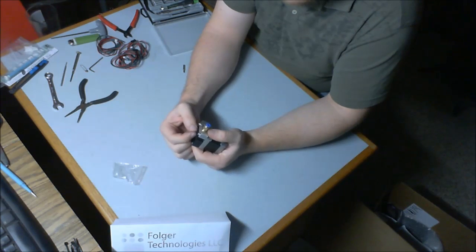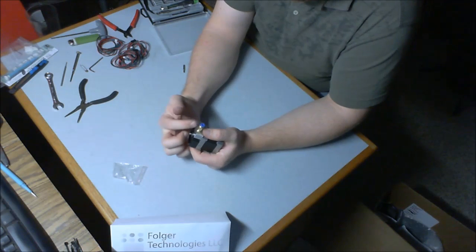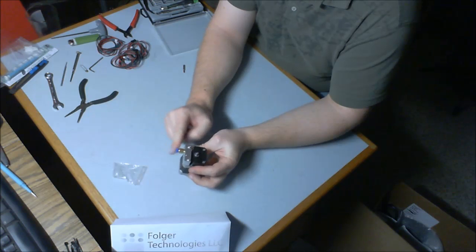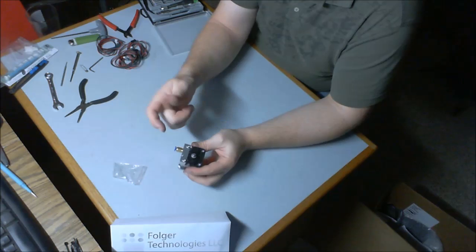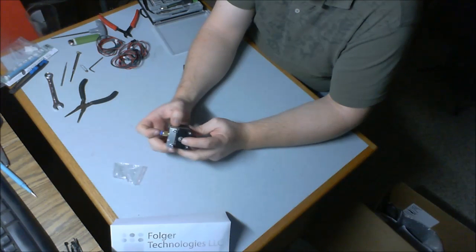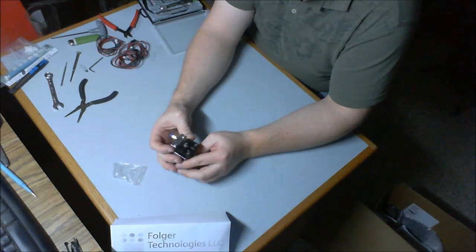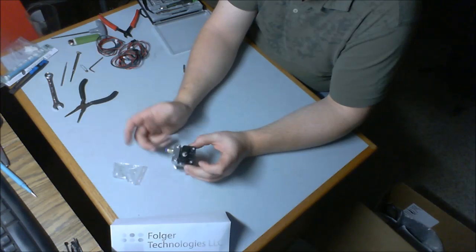The reason for that is if it's flipped around, since it's off center, it would be somewhat in line with where the filament goes, and then that will interfere with the continual pushing of filament up and out this brass connector here. So make sure that the grub screw is closer to the shaft here when you're tightening it down. And if you got it on backwards, it's simple enough. Pull the two tapered head screws, remove the plastic housing, just flip it around.